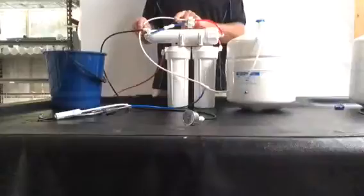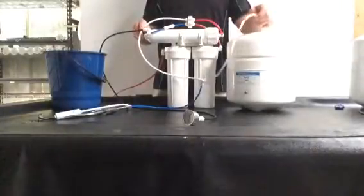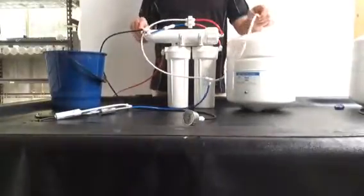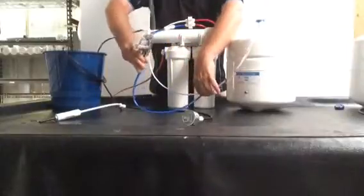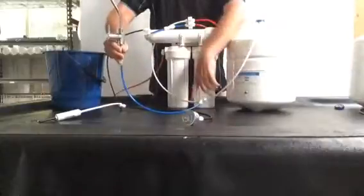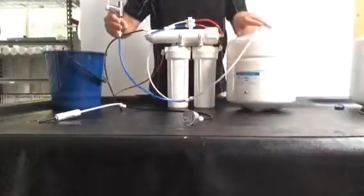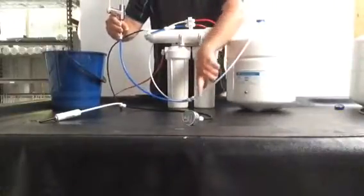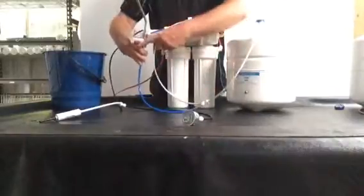This white tube comes out — it's the last part of the system coming out of the automatic shutoff valve — and it goes directly to the reverse osmosis tank. As you can see, the tank is directly connected to the water filter tap on your sink. In between here, usually clipped onto the top, there'll be your post carbon filter. As it comes out of the tank it will go through another carbon filter, which will make the water sweeter in taste and more palatable before it actually goes into the tap.